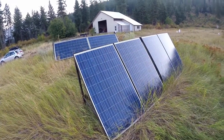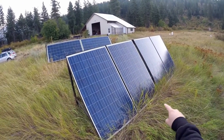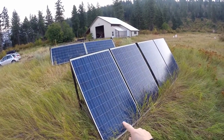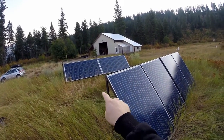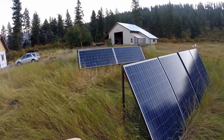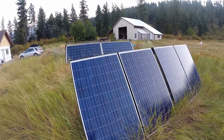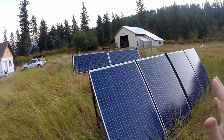These are the solar panels I have right now. I have four Canadian Solar 230 watt panels here in the front, and in the back I have two Chinese solar panels at 300 watts each. Each front panel pushes out 7.78 amps, and the rear panels are about 8.5 amps.